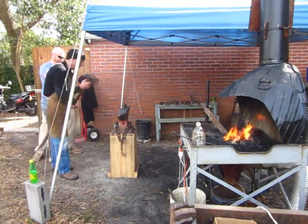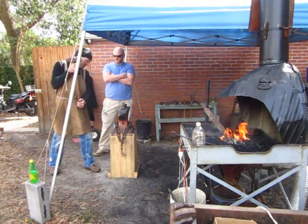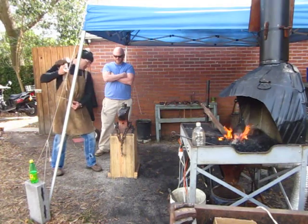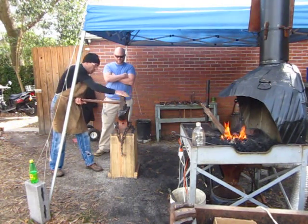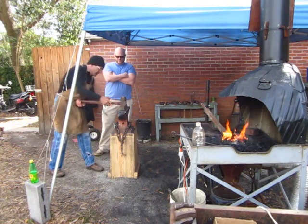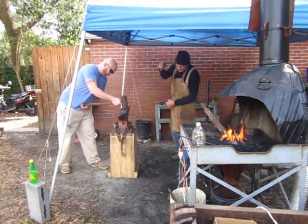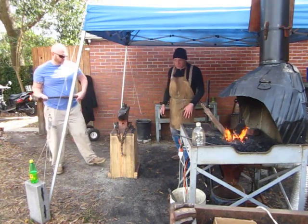And I noticed, try keeping this hand immobile. Think about putting your hand right here and just hitting. Just pivot on that left hand, and you can hit it with a little force. You don't want to really get up here too much, because we're relying on the weight of this thing. Give that a try, because it's a lot easier on you, and it gives a little more control to where this lands. I think it's less exerted. So you're taking the weight, you're pounding with the weight, but not doing the rotation. Give it a try, see how it feels.